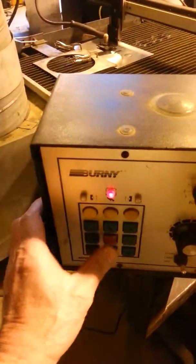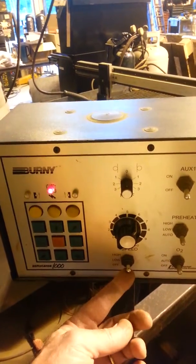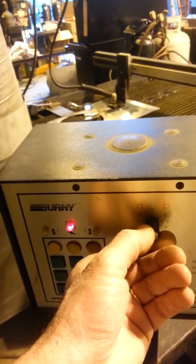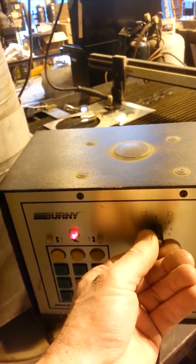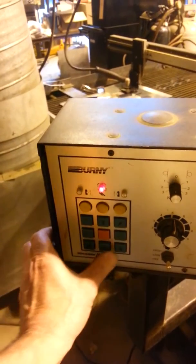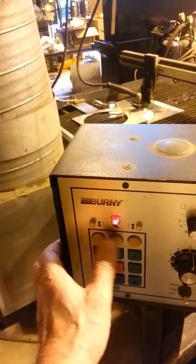This is only thin gauge aluminum. We can stop at a few different positions — we can turn it off here. We've got low and high speed on this range here, and then another speed control. This is kerf — depending on what side of the line you want to cut, you can adjust your kerf to bring it away from the line a little bit so it's more even, and make an adjustment there. And then you have all your jogging positions, and whether you want to be on the inside or outside of the line, those buttons there.